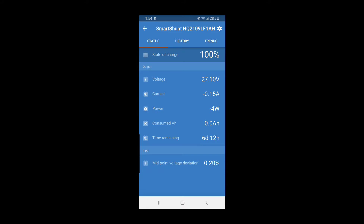This is what I was talking about — you can monitor everything on your battery. With the power on you can see the whole circuit at 27 volts with the two batteries in series. At the bottom it shows the midpoint voltage — the battery deviation is about 0.2 to 0.3 percent from the other battery, which is barely anything.